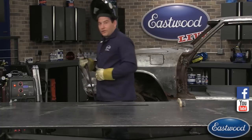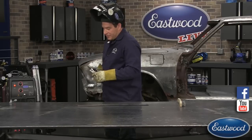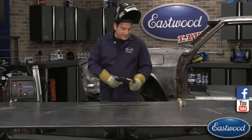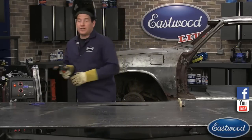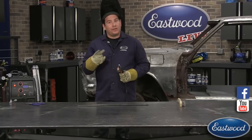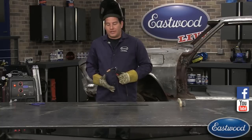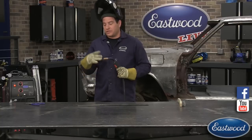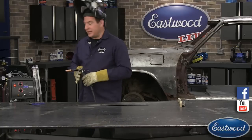So you want to get that little BB or ball on the end there. We want to cut that guy off. It's always good practice to cut off that little bit that gets on the end, because your first weld might be a little too cold, since it has to burn off that additional ball of weld on the end before you start welding. If you start with a fresh cut on the wire, you're going to get a nice clean weld from the beginning to the end.